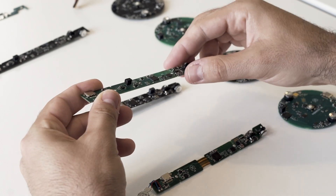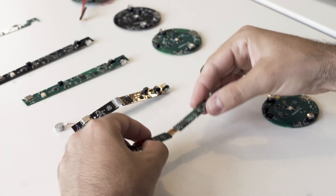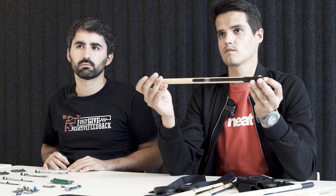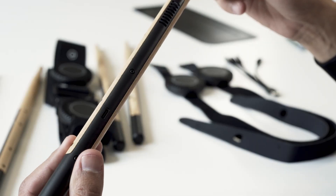All the iterations you see here are just changes in the mechanics and changes in the supply chain. Not all the components we used in the previous spin were available for the next spin, so it was a back-and-forth game of finding the right combination to make it work. We had to go for a different manufacturing technology, but the result is really interesting. In terms of ergonomics, one thing that was really important was to get the centre of gravity of the stick as close to where the hand holds it as possible, similar to a traditional drumstick. It is the thickest drumstick you can buy, the same as a traditional 2B drumstick. This plastic is a combination of ABS and polycarbonate - similar to what used to be used in mobile phones - because it's very durable and has a hard finish.